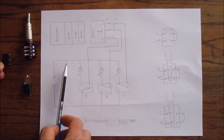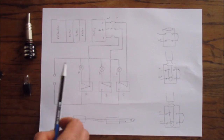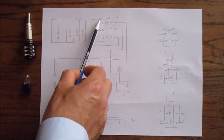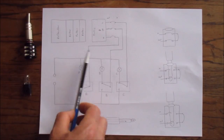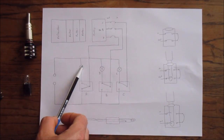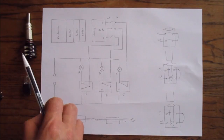The common, which is the line when the key isn't pressed, is connected to the lamp. Tracing the circuit fully: here is where the battery goes — this is the input voltage. In the normal case when a key isn't pressed, the voltage comes along, goes through the lamp, and then goes up through into the entry wheel. That connects it through to another pin, comes back through, and if no key is pressed on that side it doesn't complete the circuit.